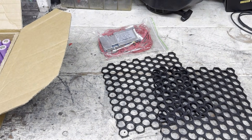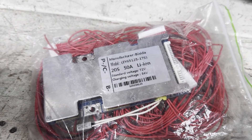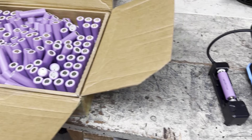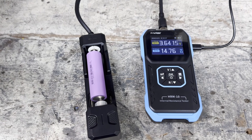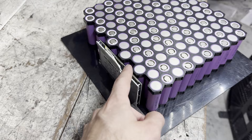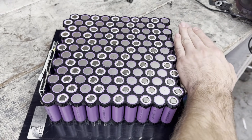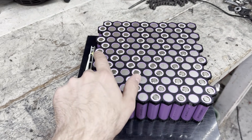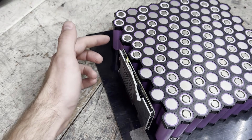I'm also going to be using hexagon cell spacers like I always do, and a 50-amp BMS from my first Razer scooter. Before putting all the cells into the spacers, I tested each one's voltage and internal resistance to make sure they're all good. Once I put all the cells in the spacers, I placed the BMS on the side and started thinking about how the current was going to flow — down one side, across the bus bar, and back on the other side, so all the main current connections will be on the same side of the pack.